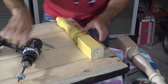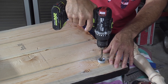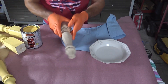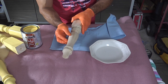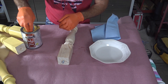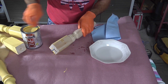Now I have my depth set. Once it hits that, I know I'm good and I back out. This is a real easy way to paint the spindles. I want it to look like wood, just like the rest, so I want to have a little bit of a wood grain. I'm going to take and water this paint down — I'll dip it in a rag with a little bit of water and wet it up. We'll just run through this and have this painted in no time.